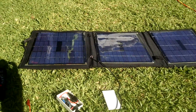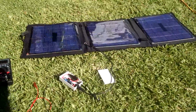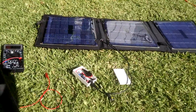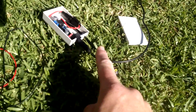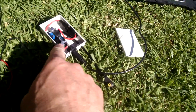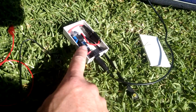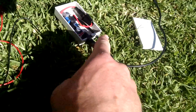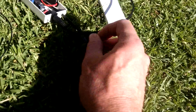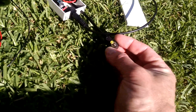I'm seeing whether it could actually power the 817 directly. What I've got is the power from the solar panel coming to this setup, which is a little 3 amp buck regulator. I've got it going through a 3 amp fuse just to be on the safe side, and bringing that out to the FT817 plug.